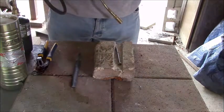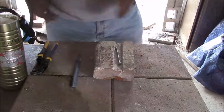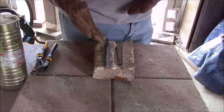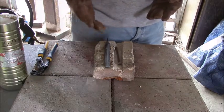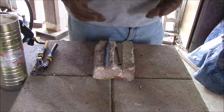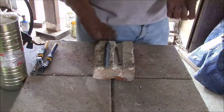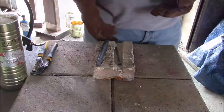Now when we're working on this, you will notice that my nail fits nicely on the block. If we're using the file here, this guy is a little bit bigger, a little bit longer, and he's going to hang over the block. That means two things to us: one, less of the metal has heat getting reflected back at it from the block; and you're going to have to worry about whether there's something down here that will burn. We don't want to set things on fire, so you keep as much of the metal on the block as possible, and you keep an eye on where your torch is at all times.